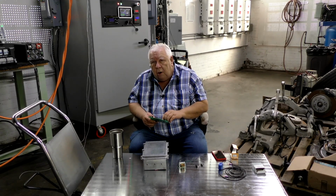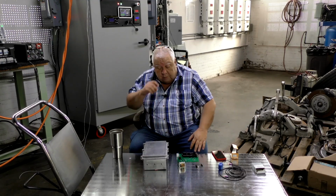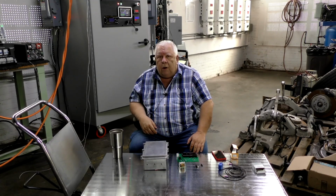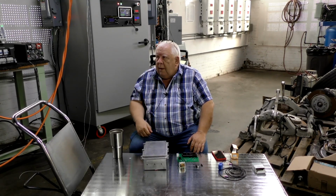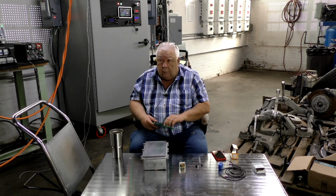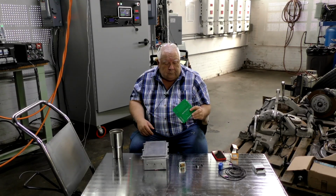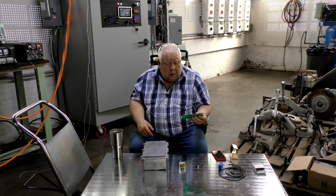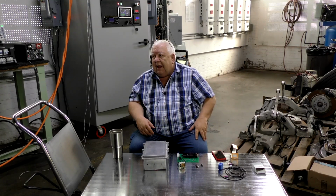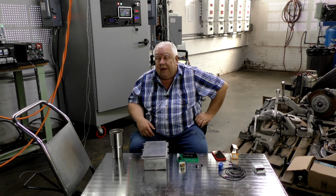This has a very specific application. It can monitor power, it can tell the direction of the power, and it's an open interface. You can get the information several ways. The recommended way is simply to monitor a UDP port for CAN messages that will be available to everything that's on that network. We think this is going to be a big addition. It may not make much of a splash, but it enables us to do some things that will.